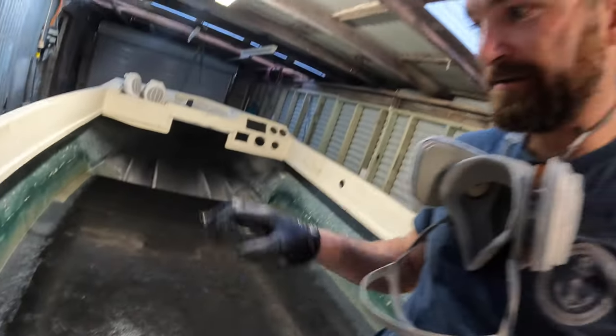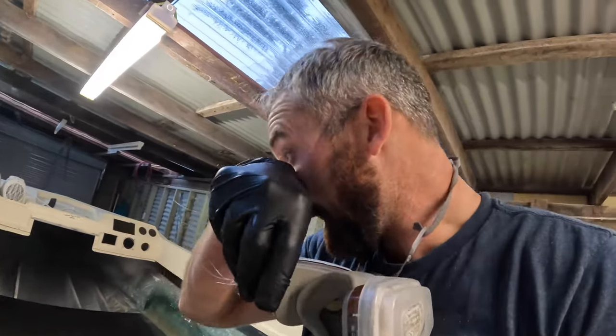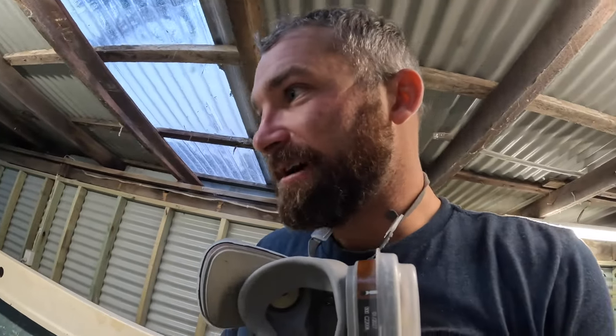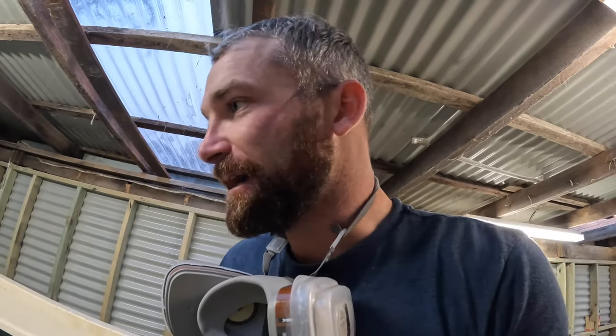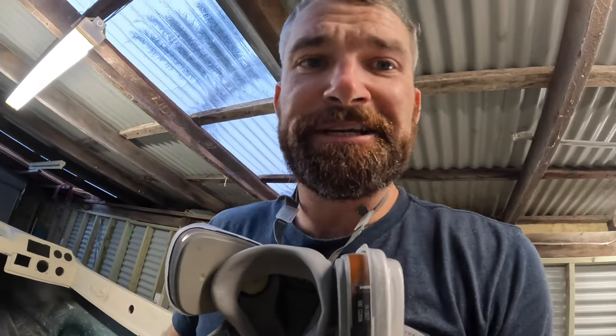Up nicely, good nice layer of resin on there. We'll let that cure overnight, and tomorrow give it a quick acetone wash, and then we'll lay straight over the top of that with chop strand mat and start building up our three layers over the floor. So 450 chop, 600 double bias, and then another layer of 450 chop. Now you notice at the end I was doing a little bit of glassing down here because I did have a little bit extra material.